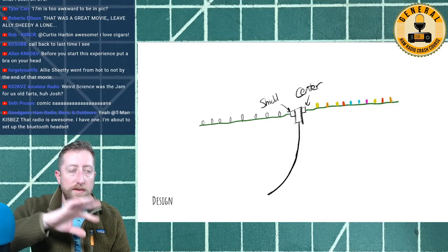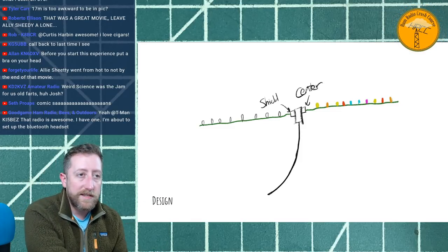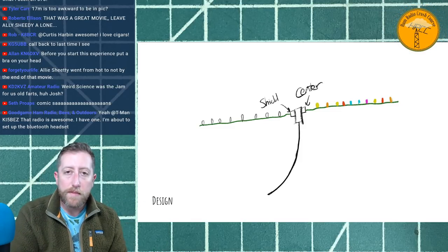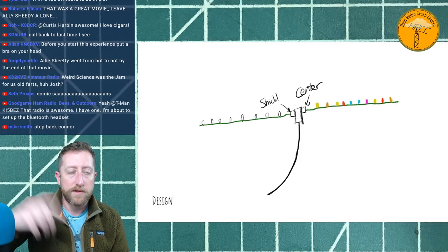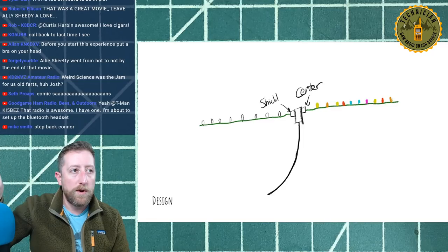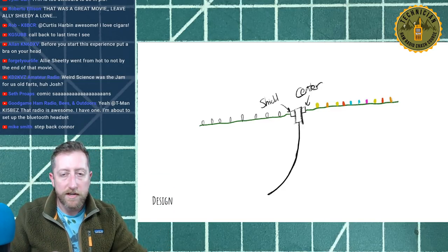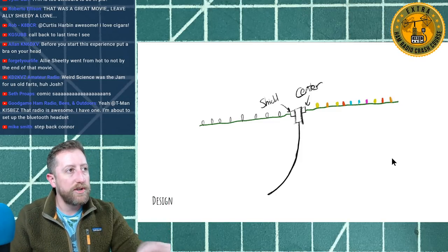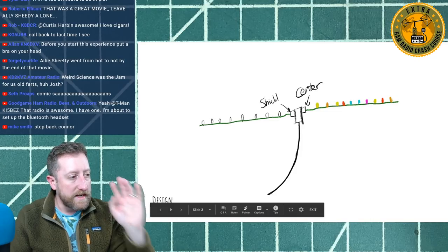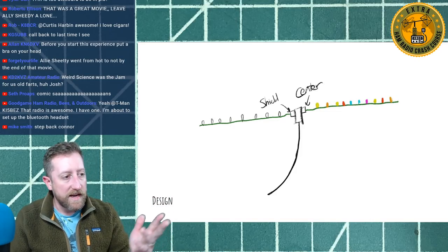Now, you notice how everything off the center connector is lit up, at least colored, and the other side just is not. Well, if you think about it, the center connector is where your RF is basically going out, where that power is going out. So it's going down that one leg and lighting up the other side, not so much, right? So that's kind of what happens if you do it the traditional build way, which is what we did. In the future, I might do something a little bit different, but you get the idea.